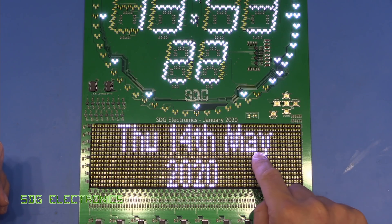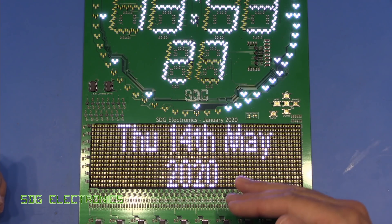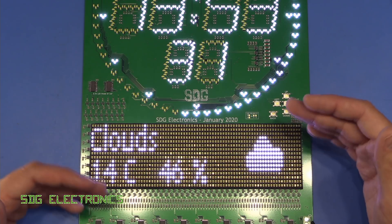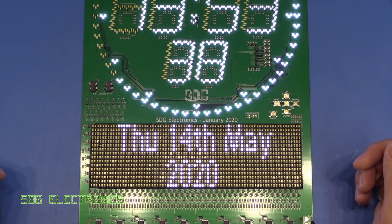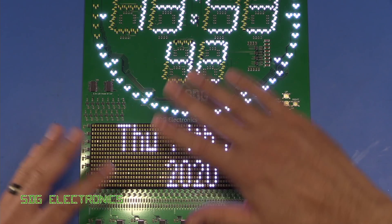What I've ended up having to do is increase the PWM frequency for the brightness control all the way up to 100 kilohertz, just so that it never beats against the multiplex frequency. I was a little bit concerned about how much emissions we'd actually have from this clock now that we've got some quite high frequencies all over the board.